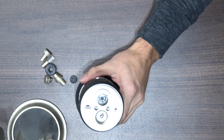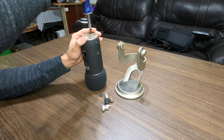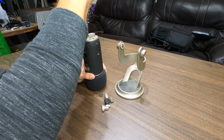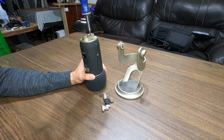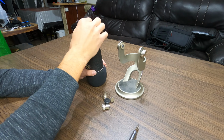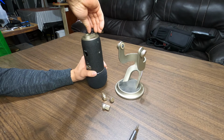After you've verified that your microphone works the way you want it to, go ahead and slide the shell back over the microphone. You'll start by screwing in the 3 screws that hold the shell to the body. Make sure the longer screw goes in the middle hole, otherwise you could potentially damage things. After you have the 3 screws in and tightened down, you'll want to go ahead and put your rubber pad back in and screw in the threaded adapter for a microphone stand.